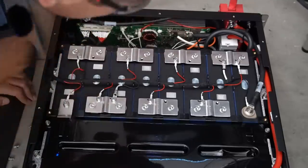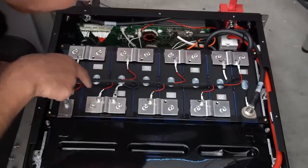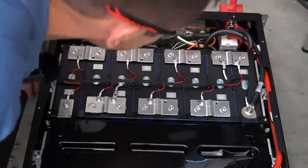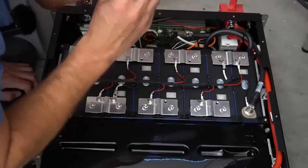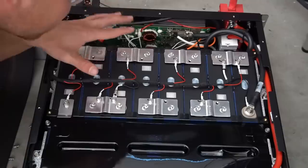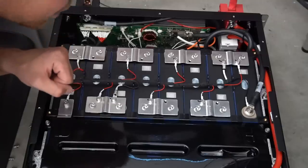There's a pre-charge resistor. This is a high quality pack and these are brand spanking new cells — incredible build quality. I don't think you can find better. All of the crimp connections, everything on the board looks really good. The balance plug is even glued in, conformal coating, inductors — everything's glued down. This is a perfect battery build right here; I don't see a single issue.